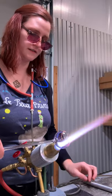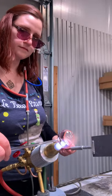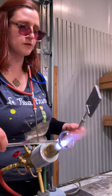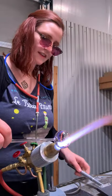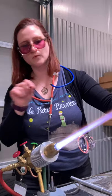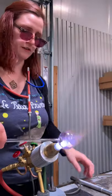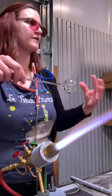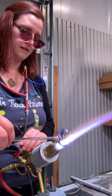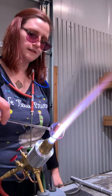So I'm just going to heat the very end like this and let it thicken up a little bit. I do all my cups this way. I love flame cutting. So I'm letting it thicken up, and just by heating that very end it kind of is normalizing itself. You can do the swipe if you have any real blips — the wiping technique to clean it up — or you can use your shears a little bit. Any weirdness you have here is going to be amplified once you flare it out, so it's good to clean up as much as you can now. I'm just going to thicken up until it's about the same thickness of the rest of the form.